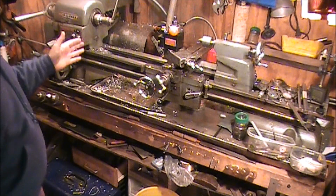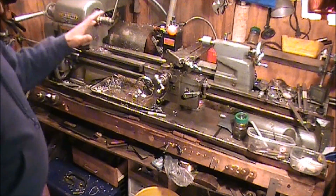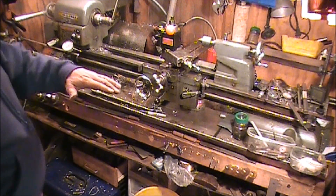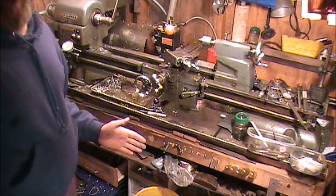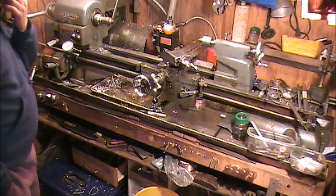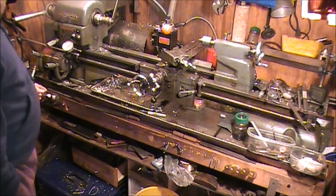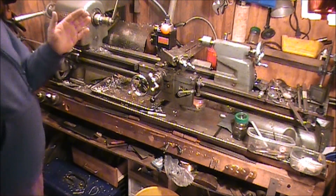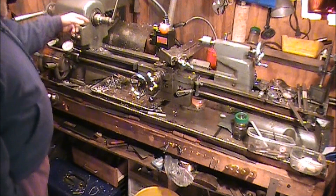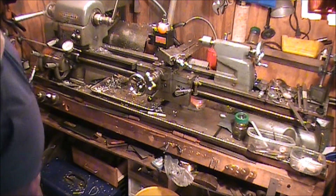So I bought several gears. We're going to go into the drive frame for this part of it and change a couple of gears. Basically we're going to cut the feed rate in half — about 50%. So instead of 4.2 thousandths per revolution, it'll be 2.1 thousandths per revolution. Let's go ahead and try to get started and see if we can get this thing done.